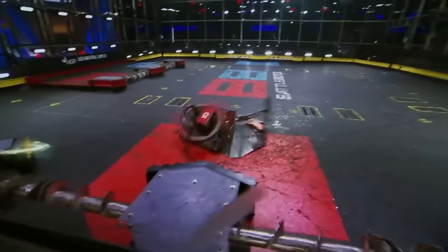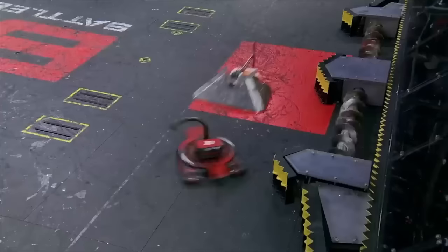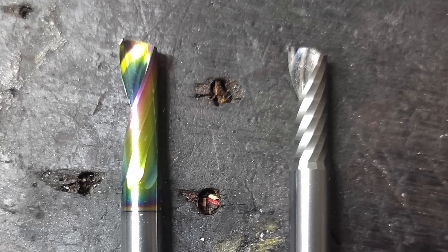The plastic form is a very simple piece, but with a unique end mill specialized for it. One could use a generic end mill just fine, but these single tooth ones prove very effective to me. The single tooth allows lots of space for chips to be evacuated and avoid recutting, and compared to the aluminium variant, it has extra grooves which apparently do something. I'm not exactly sure what, but it does a very good job of destroying plastics in a controlled manner.